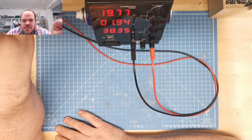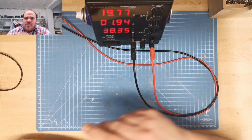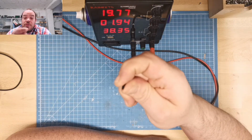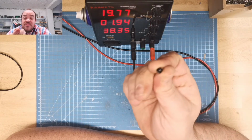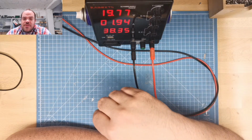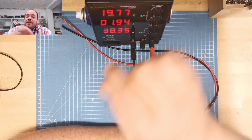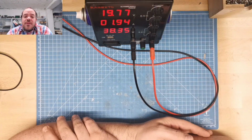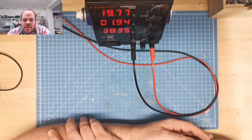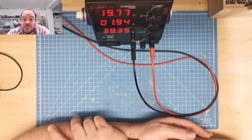The isolation inside, I'm not sure if it is a good idea to use the anodized black screws, and without star washers, the little washers that have the spikes. It's really better to make contact to the metal, to the earth connection. And so this is not perfect.